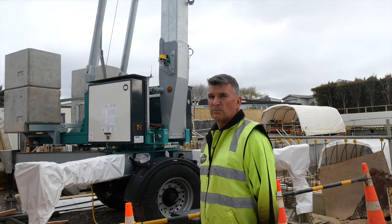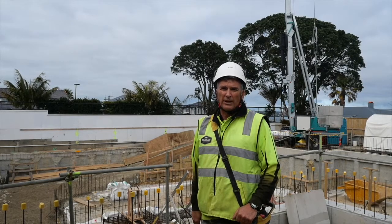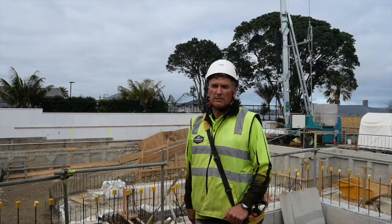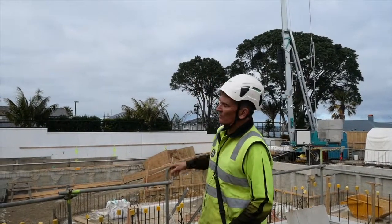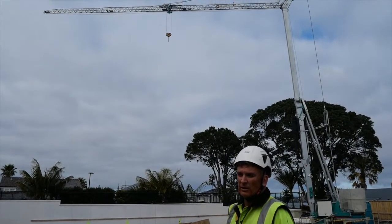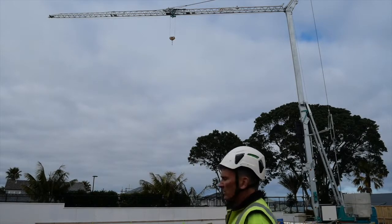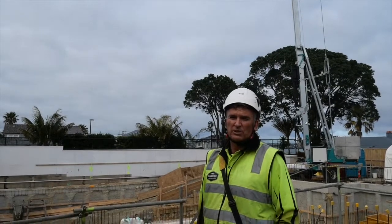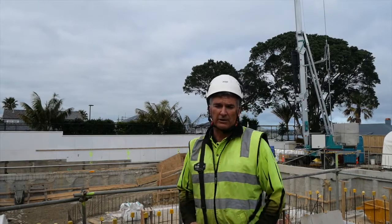All right, now we'll start to operate the crane, and we'll show you how it goes. We're going to fold the crane up and lower it down. It's about a 5 or 6 minute procedure, so we'll speed it up a little bit, but it's really simple. We bring the trolley to a specific point at the center of the jib section, and then I alter a couple of buttons on the crane panel inside the box on the side of it. It's really simple. Two switches, and then we use exactly the same remote to lower it with, so let's give it a go.